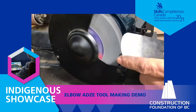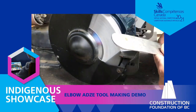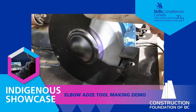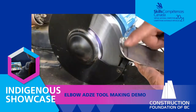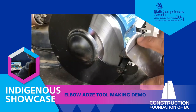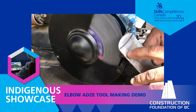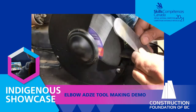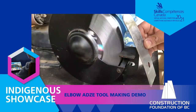Now that I've put on the profile of my blade, it's time to put the bevel on. With this particular Skidoo spring you can see there's a bit of a bow in the spring itself — you want to put the bevel on the bow side. I've already started it, made a couple of passes, and I've drawn on wherever I want the bevel to come back to. I start from this line, move forward against the guard, moving across the face of the grinding stone. This will be the bulk of the work, and then we'll move to using the files.